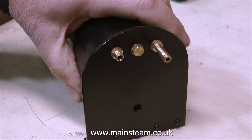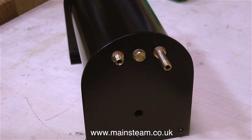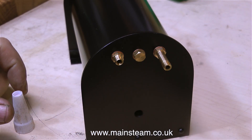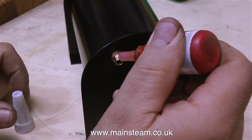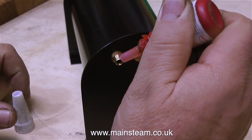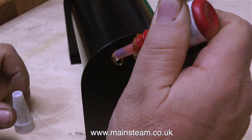They're all going in there quite successfully. In this clip, I'm about to fit a right-angled elbow to the first of the brass fittings. I'm going to use some Loctite 542 as usual, to make sure that the fitting doesn't leak. A word of caution when using Loctite 542: be very careful with it near paint, because it does remove paint — it's quite an effective paint remover, as I found out to my cost once or twice in the past.